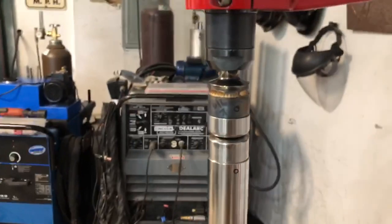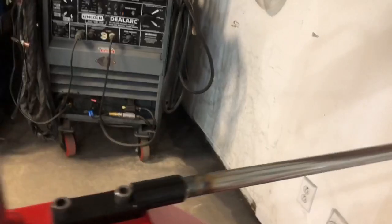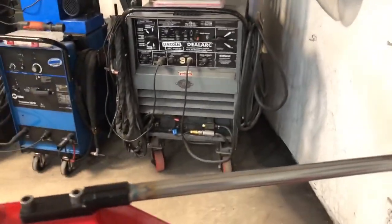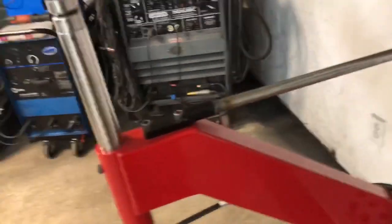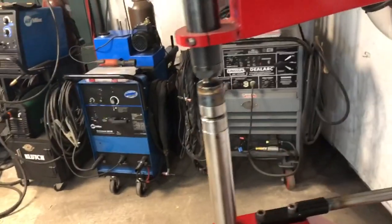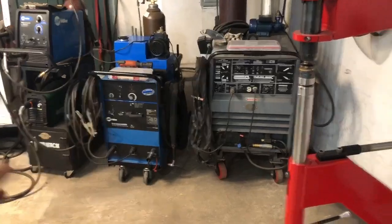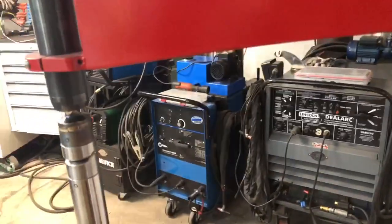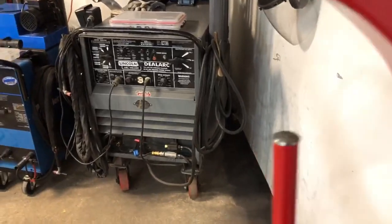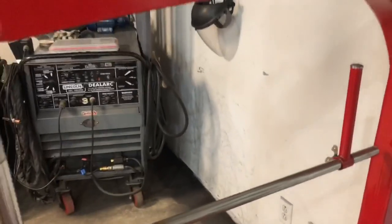So obviously you can see that I have it set up. That's pretty much the height that I feel comfortable with. This thing here I came up with, I've seen it on other models, and it's more like a Yoder hammer or power hammer model. If I'm working a big panel, this is a 26-inch throat. So if I'm out here at 52 inches, somewhere out in this distance, I can't hold that up out here. So I machined a little thing, jammed it into a piece of tubing, and put basically a wing nut. I can put this wherever I want, but it's basically like a third hand.